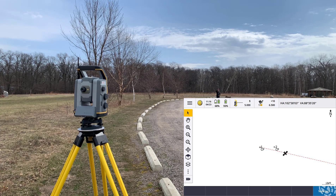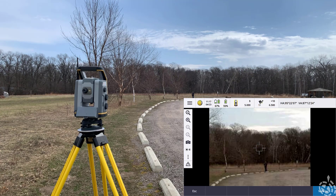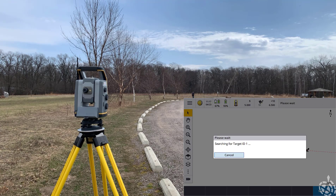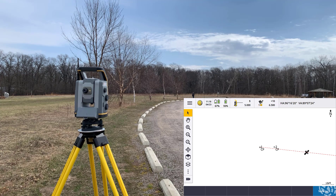If I go ahead and hit my F4, the total station will turn within that two to four meter range and try to lock onto you. The further away you are from the instrument the quicker that lock will happen because it has that fanning beam where it's looking for you. Let me try that again out a little ways. I'll hit my video so you can see where it's at — since I was closer the instrument was pointing a little bit higher. I'm further out now, my multi-track is on, so I'll hit my F4. Searching — goes into search mode — target ID locked. There we have locked on. Great tool. It speeds up the workflow especially if you have a lot of things going on on that job site, a lot of movement happening. If your instrument doesn't have that video function, GPS search is going to take away a lot of that downtime used for searching and looking for you. All you need to know is how to turn it on and how to use it correctly.